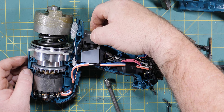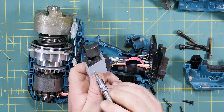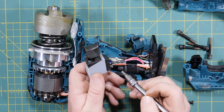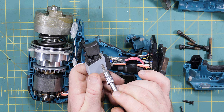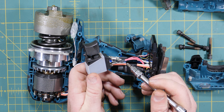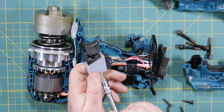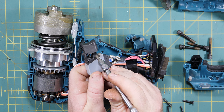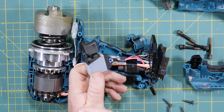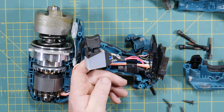Let's have a look at the switch. That's your forward and backward engagement. One thing of note is the switch has got three lines, so it's not just an on-off switch - it's actually proportional. There'll be some sort of potentiometer or variable resistor in there that tells you how much you're pushing the switch and therefore how fast the motor should be turning. And there's also a bellow on here as well, which stops dust, grease, and whatever from getting into your switch mechanism.